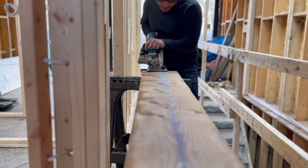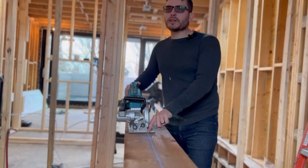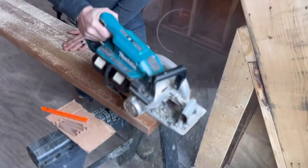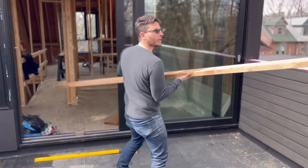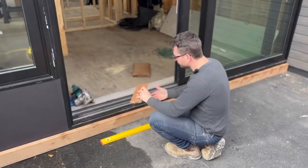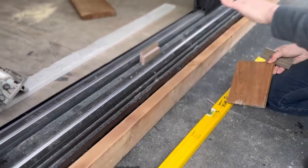Set your cursor up to your line and follow. Here's where we're at the center point — we're going to have to start making a turn the other way, so you have to make sure you adjust your blade. Keep an eye on your cursor so you know where your blade is going to be. Here's a piece that'll be the thickness of our flooring — the ipe decking. That's the amount we have to shim it up in order to not only give adequate drainage but to make it perfect, because the roof is not going to be an exact science itself.